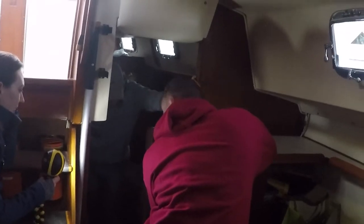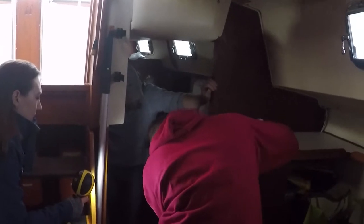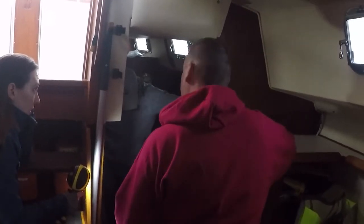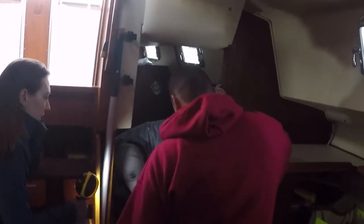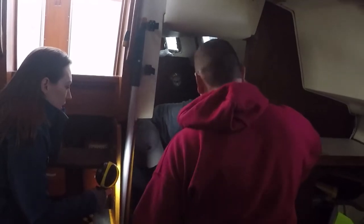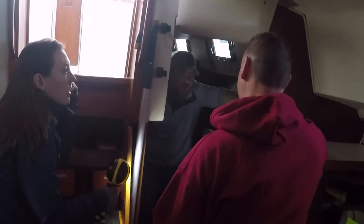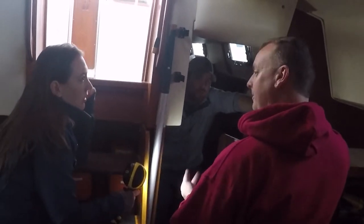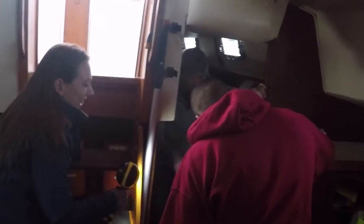This is your 110 panel — this is your shore power. This is everything on battery. Once we get hooked up on battery or shore power, which we should do pretty quick, we'll check your batteries. And why that's important is — say you're gone from the boat for a week and your seacock busts open and your bilge starts flowing with water and your pump comes on. If you've got a bad battery, your bilge pump is going to drain and then stop pumping. Looks like you've got some switches here you're going to have to figure out.